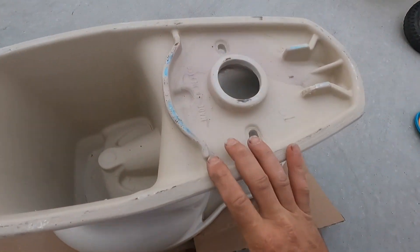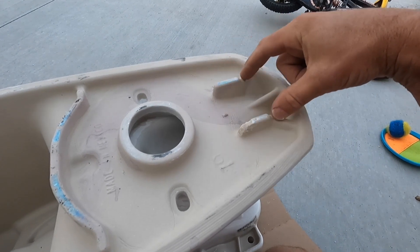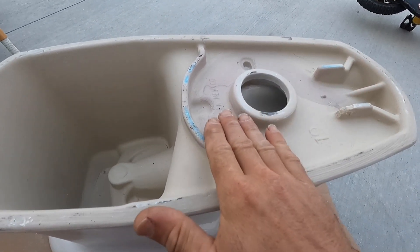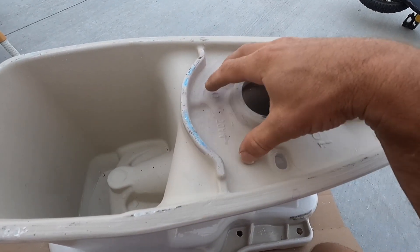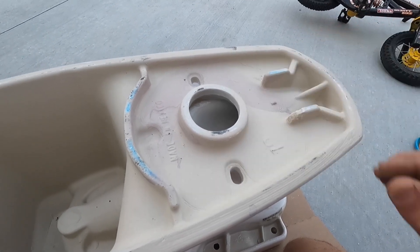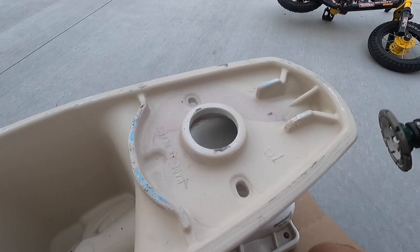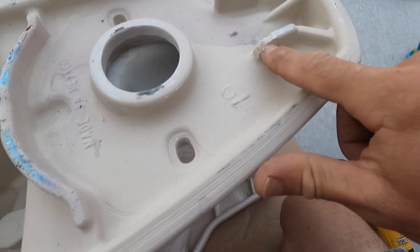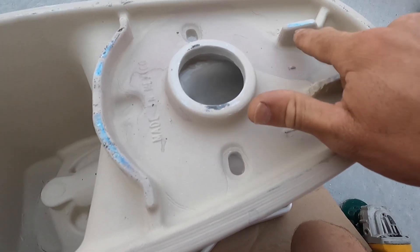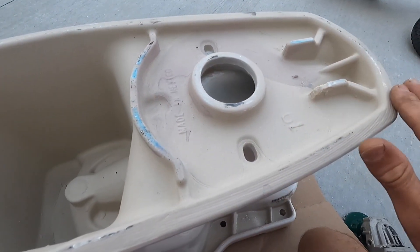It might be a little unconventional, but here's the base of the toilet sitting upside down — this is the part that goes over your plumbing. These two points and this ring are all level with each other and that's what sits on the floor. But being that right up around that flange the concrete is a little bit higher, these parts hit the concrete first. So what I'm going to do is take a diamond grinder — just a diamond wheel on my grinder — and I'm going to grind these down. What that does is it allows the whole base to sit flat on the floor.